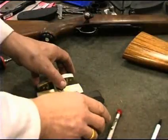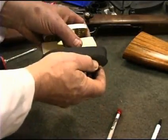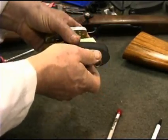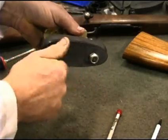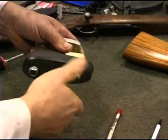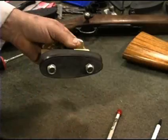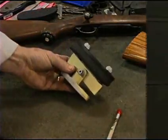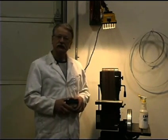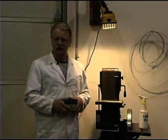Mount the pad on the jig upside down, being careful not to over-tighten or you will cause the rubber to overexpand and undercut. Don't forget that when grinding, overhead lighting is extremely important. Please be sure to use the proper safety equipment when grinding and polishing.